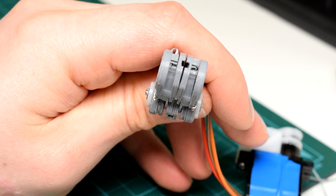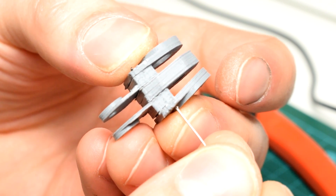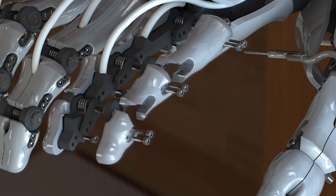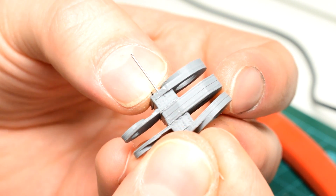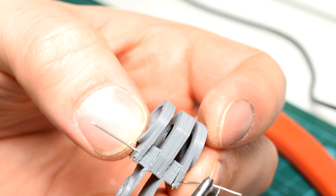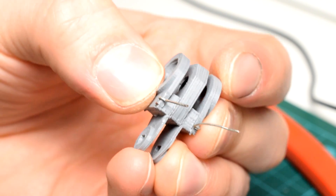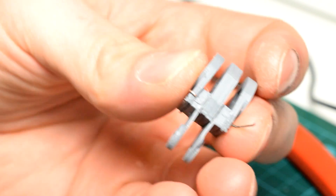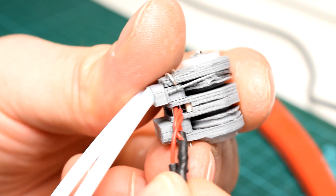Since the potentiometer I'm using can rotate 360 degrees, there's no need to worry and the motor can just keep spinning until it's at exactly the right position, which is really handy and means there's no need to calibrate the servos whatsoever. Because my printer is FDM and some of these joints are very complex and need to fit precisely to different components, I've sliced up the joint into several little slices. On my original design I screwed the parts together with M1.6 screws, which added a ton of weight. In this design I have half a millimeter holes running through, so a thin wire or potentially some brass rod can be used to align all the pieces and increase the strength beyond regular interlocking if it was all 3D printed.